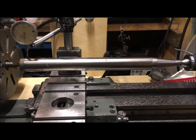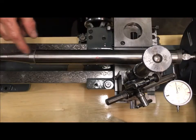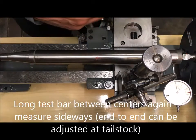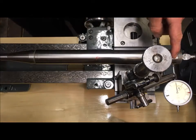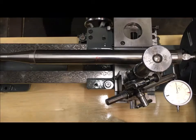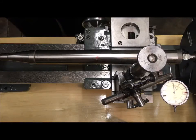That was one test, and this is the same test as longitudinal feed. I mounted the camera pointing downwards at the rear of the machine, so this is pressure towards me here. I can of course adjust this error out, but this is a proof that the longitudinal axis, I adjust it there, is okay.